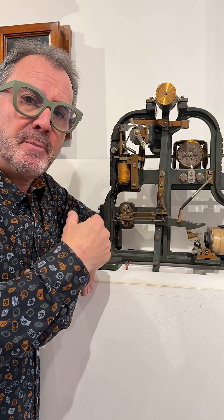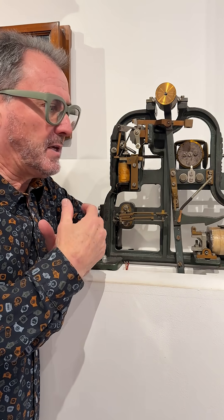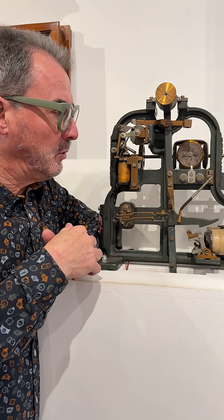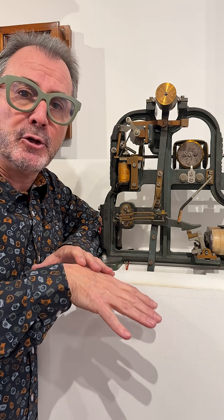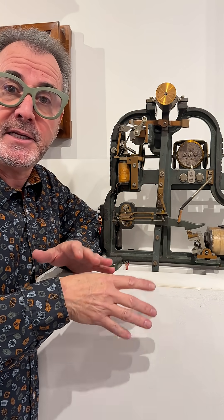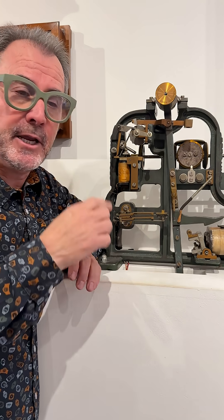At the end of those 26 seconds, it puts itself into what we could call waiting mode — it's saying: okay, I'm ready to receive a pulse from an external source that tells me it's okay to go. And that external source will be a clock that we put in a good location downstairs, easy to maintain, easy to regulate, easy to look after, which each half minute will send an accurate pulse.